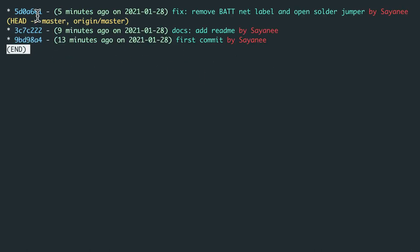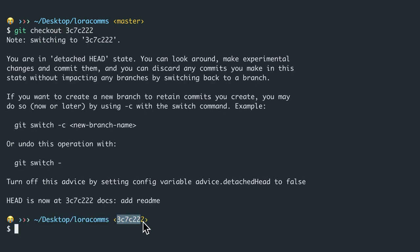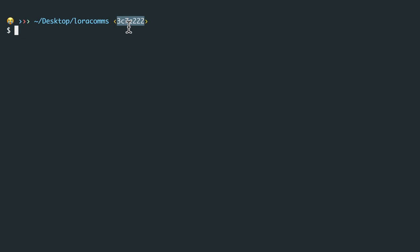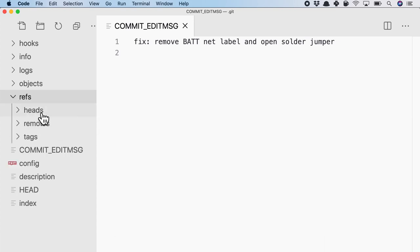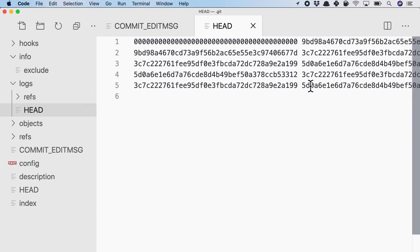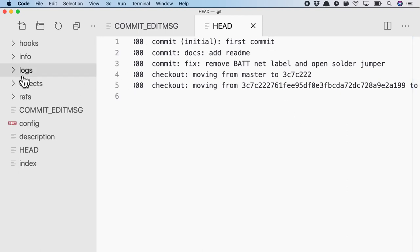Running my custom gl alias shows just three commits. If you want to go back to the commit before we removed the BAT net label and solder jumper, copy the SHA1, come to the master branch, and do git checkout with that SHA1. The state changes to that commit. Opening the project folder and schematic, zooming in, we can see the stranded net label and solder jumper. To go back to HEAD just say git checkout master. We can also look inside the .git folder — under refs you see the master branch SHA1, and under logs/HEAD you can see all SHA1 commits and their details including commit messages.